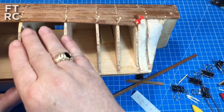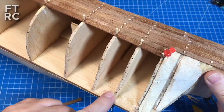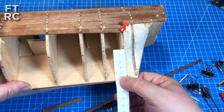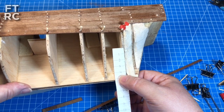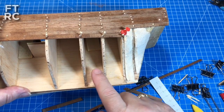This curves differently. Completely different to here, which is bowing out. Okay? This here is just a single curve bowing out. Here's a complex curve that goes out and it comes in, and it's actually longer because it's got more wobbliness. Okay? So here we have our six planks, even if we didn't taper them, are only going to go to 42, and we need 48. So what happens is we start putting wedges in, and more of that in the next video.